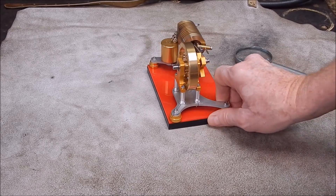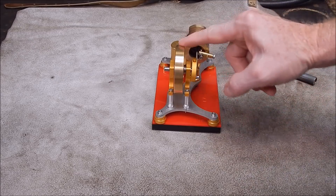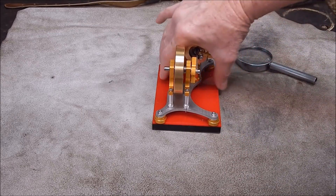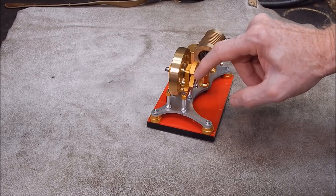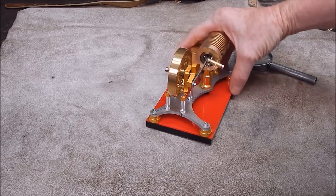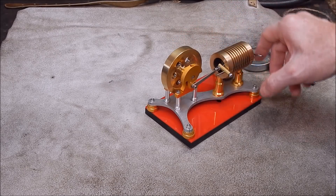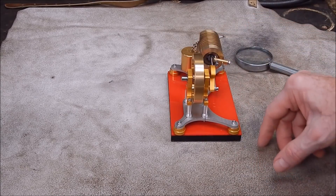The first thing I'm not happy about is the runout in the flywheel — look at that, it could be a lot better. What I thought was a spring down there was just spacer washers. The spacer washer on this side is just floating around doing absolutely nothing. This arm comes in close to the journal, to the counterbalance weight, so I think it could be aligned a bit better. The main thing I want to do first off is square up that flywheel, which is pretty abysmal.